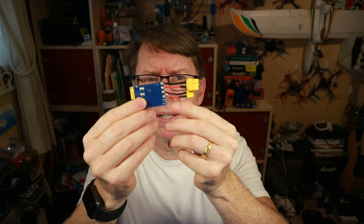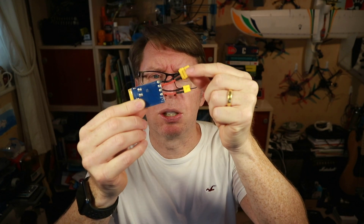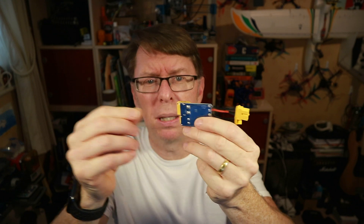What is this? In this bag is something called the ViFly Short Saver. What is a short saver? Essentially it's something that you should use the first time you plug something in — it will detect if you've got a short and shut off voltage to it. Getting it out of the bag: you get the short saver itself, with connections for XT60 and XT30. You plug the battery in one end and the quad in the other, and it comes with a little manual.